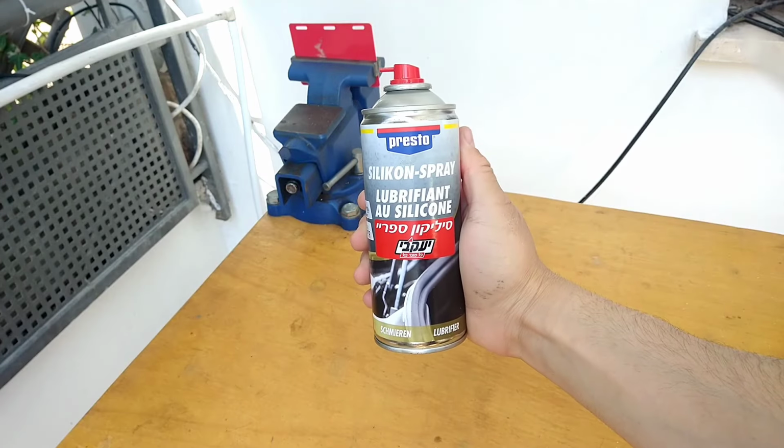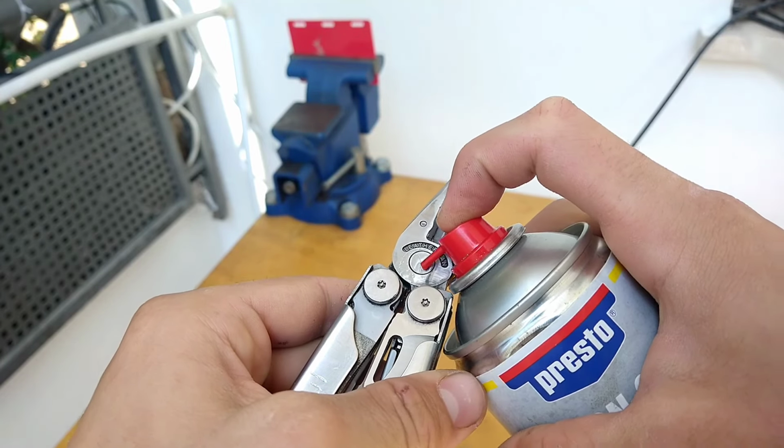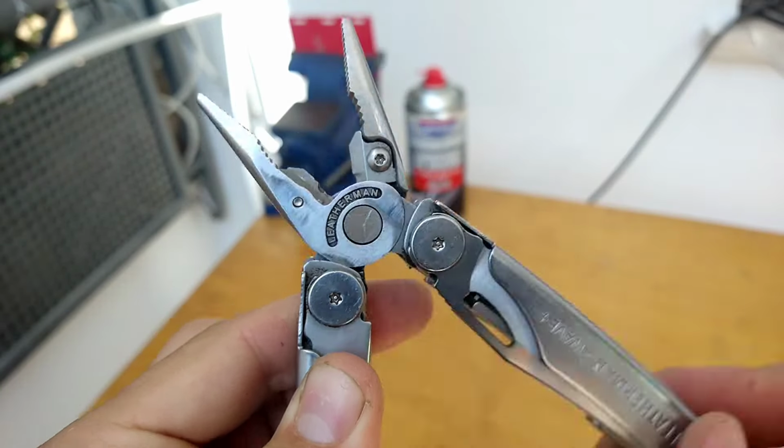them with my fingernails. To loosen them, I spray a thin lubricant into the hinge. Any lubricant should work, just avoid using WD-40 or motor oil. I find Teflon and silicone-based ones to work exceptionally well.